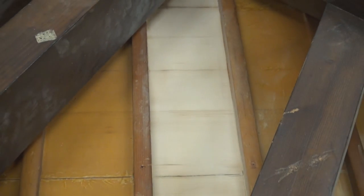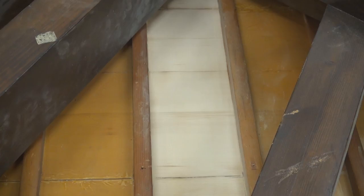Okay, all done. The scratches from the hand sanding are gone. It's very smooth and it should accept a very nice finish. Now granted, there are going to still be areas where the machine doesn't reach very well either, but at the same time, if the machine can't reach behind those areas, chances are you can't see behind those areas either. So it's not going to make a whole lot of difference. The point is, the majority of it is going to be clean. It's not going to have scratches all over it, and it'll accept a nice finish, and it'll look great.